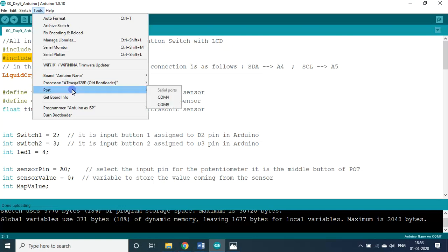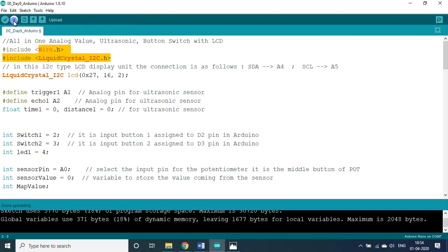When uploading, select whether you are using Arduino Nano with ATmega328P, old bootloader, or ATmega168. The port is important — you will get a new port number when you insert the USB cable. Configure that port number, then press the upload button and the program will be flashed.